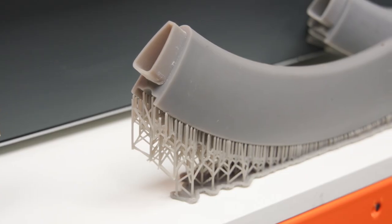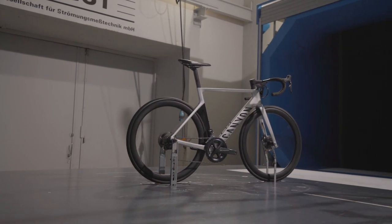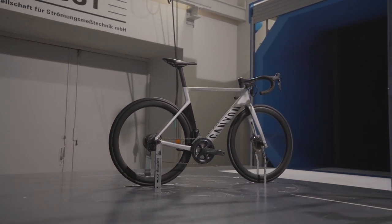For the 48 Limitless wheel or the 42 Gravel Limitless wheel, that's the project which we run start to finish. We CFD those profiles and we develop 3D printed shapes. We take those to a wind tunnel, we test them, we refine that external shape, and then we work with a supplier — most of those are in Taiwan or mainland China — to create that mould and then create a layup that delivers the physical characteristics we need within that shape. That's really what the process looks like from start to finish.